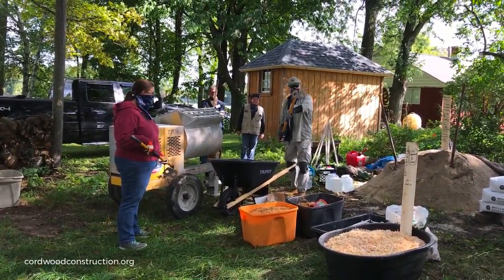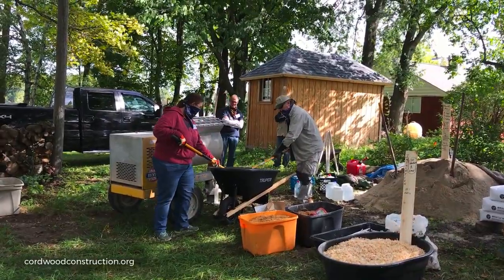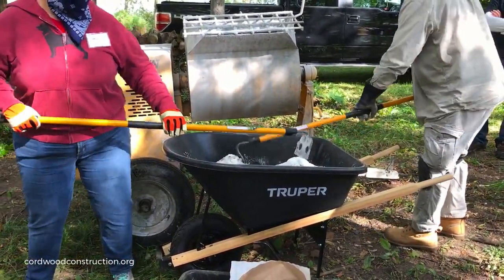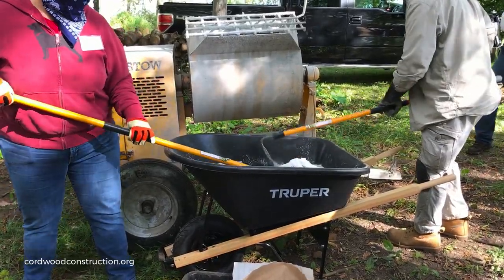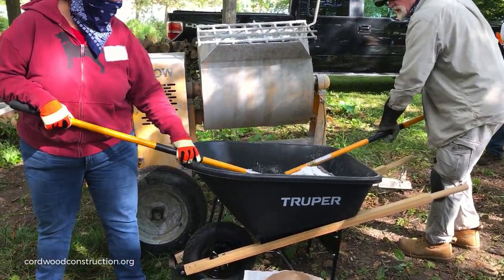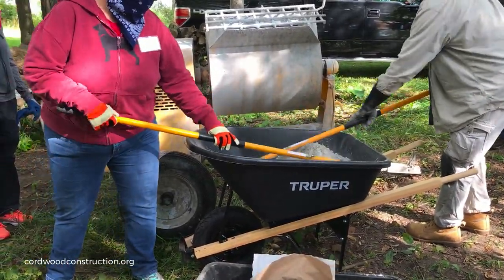So I'm going to grab, I can do it like this, and I'm going to start chopping. You're going to take this side. And you're going to chop your part towards you. So I'm going to go chop, chop. Then I'm going to switch to this side. You're going to switch to that side. And I'm going to chop. I'm going to try to chop off about 1/4 of an inch each time with my blade. I'm going to raise my blade up, come down 1/4 of an inch, raise my blade up, come down 1/4 of an inch, and then pull it all that I can toward me.